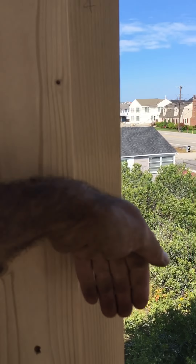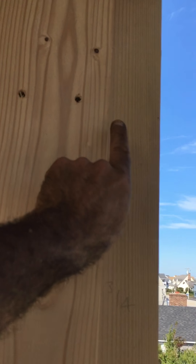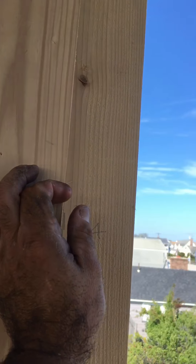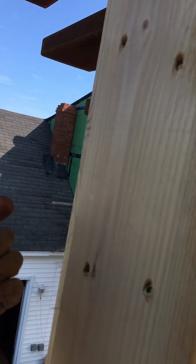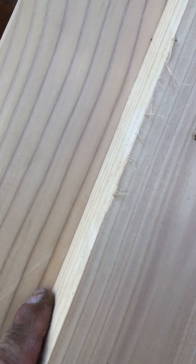The thermal bridge detail wraps inside — even on the sills, the sills come up and it wraps in, and the head comes up and wraps in. After that the insulation goes on, and then 16-gauge sheet material comes and wraps and profiles in at the caulk joint — the caulk joint happens here. So when you look from this direction up, you don't see the caulking. We can seal the caulking — it's a three-eighths inch caulk joint. The windows all have a three-eighths inch caulk joint, and I get some spray foam from the inside. On the outside it gets a nailing flange which comes and hits the thermal bridge thickness here, folds there, and gets caulked.